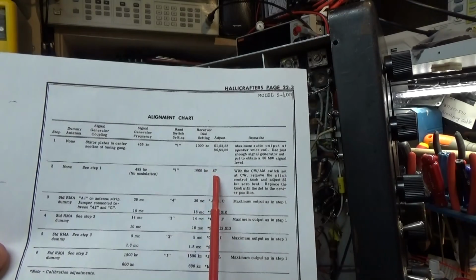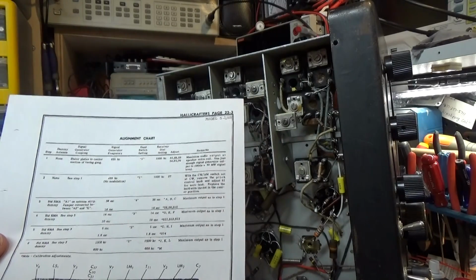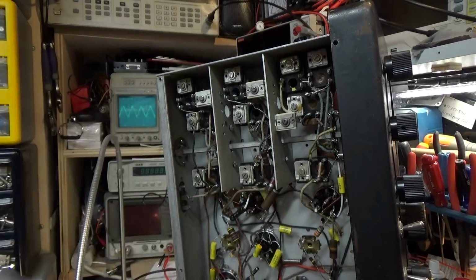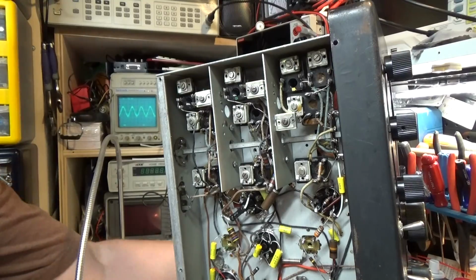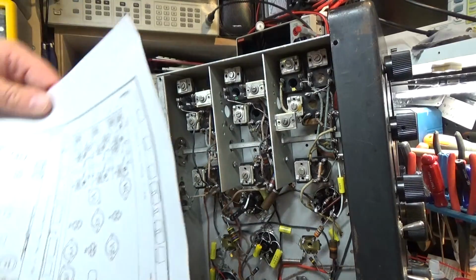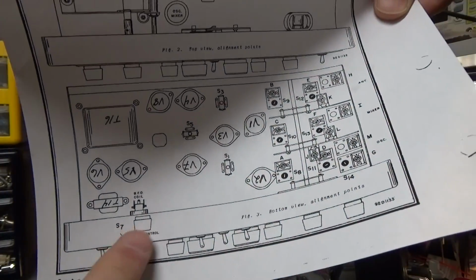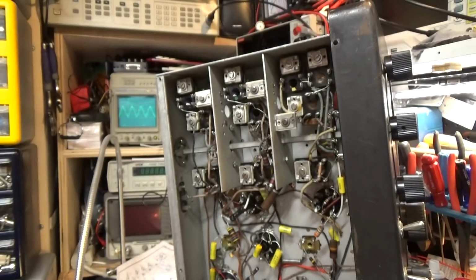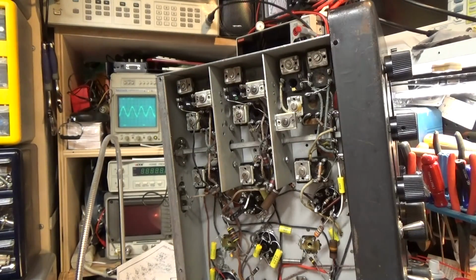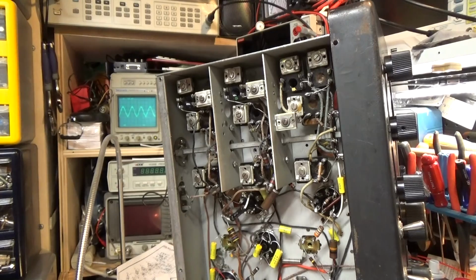And if you look, you're going to adjust S7, okay? And I'm assuming that S7 is going to be the actual BFO pitch knob, and you can see it is. So if we look right here, S7, BFO pitch control knob. What they want you to do is set it for a perfect beat frequency, for a zero beat, and you're going to hear this as long as it's working.